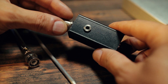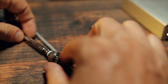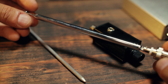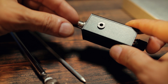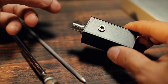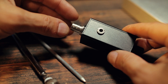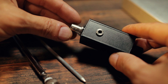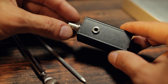Experiment with the antennas — you can connect either a telescopic antenna like the one I have here, which I think is about 70 to 80 centimeters, or if you want, you can even use a long wire, maybe 10 meters — the signal would be a lot stronger. Just make sure to keep it away from trees and other obstacles, because they will influence your received signal.